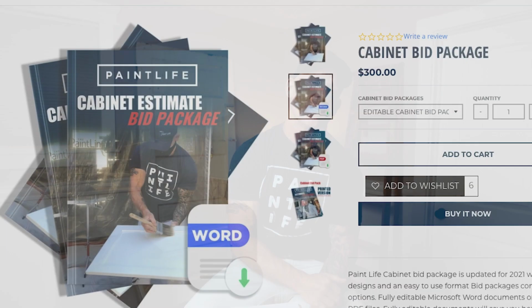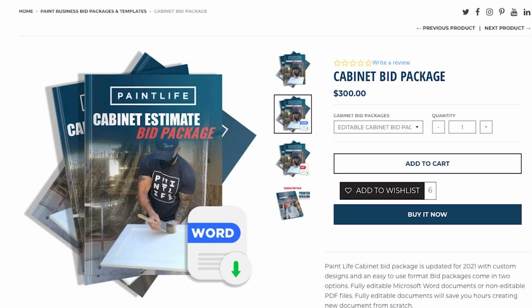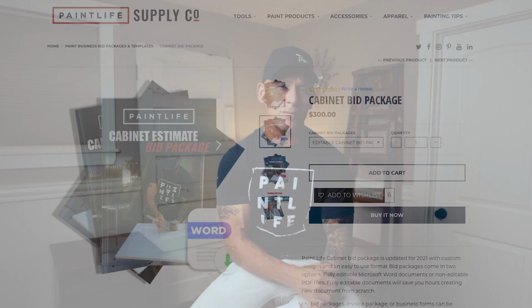It's good for your customer. It's good for you for confidence when it comes to warranties. So you're less likely to have warranty related issues, especially like us. We're giving a guarantee of 5 years on all of our cabinet repaints and coatings. So it's highly, highly recommended to catalyze your top coats.